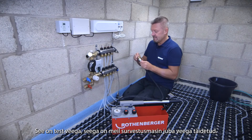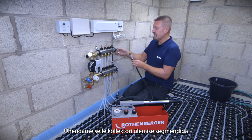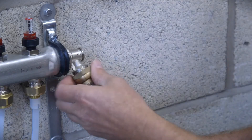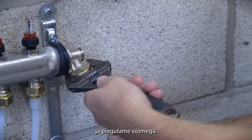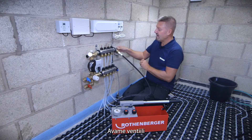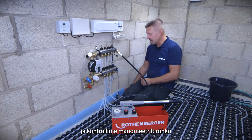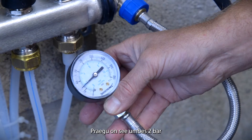This is a hydraulic wet pressure tester — there's water in the reservoir already. We're just going to attach this to the top flow port of the manifold with the washer on there and nip it up with the spanner. Open up the vent port on the top, then you can check the pressure on the gauge — in this case we're looking at just under two bar.